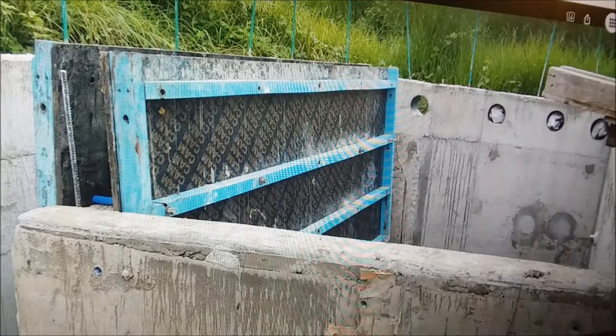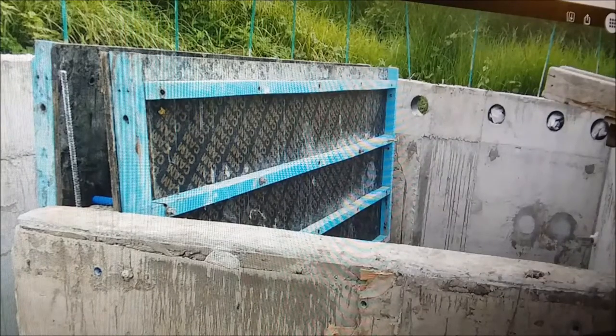We're pouring a divider wall — air can come down either side and out the other end. There are black holes on both end walls. That's the only place with a full-height divider wall that goes right up to the lid. The camera is in digester 2, which is crosswise left to right and gets the gray water. Gray water doesn't go into the black water — black water is all its own — gray water gets a different bacteria. We call this the T wall; there'll be another piece of wall to the left that's just not poured yet.